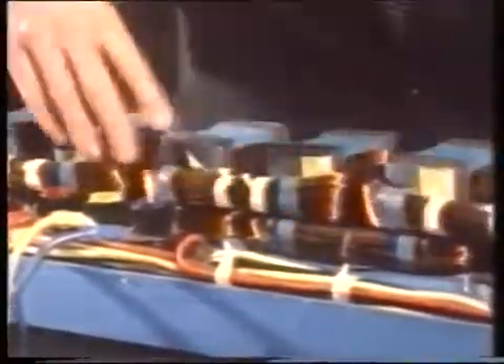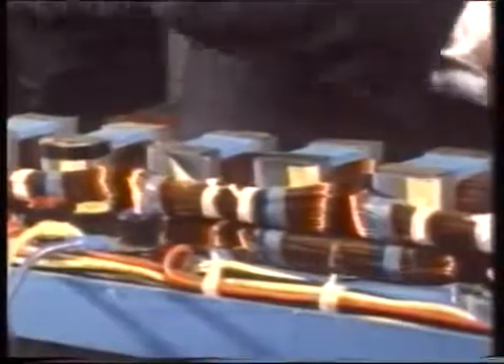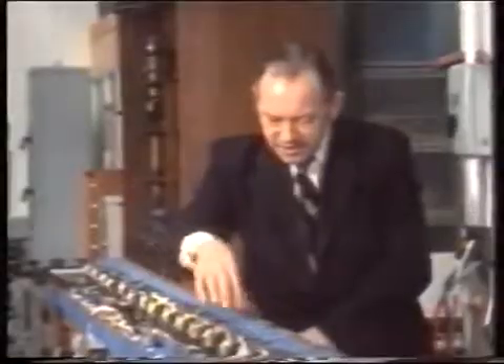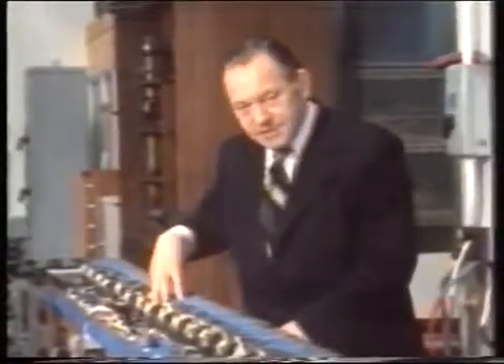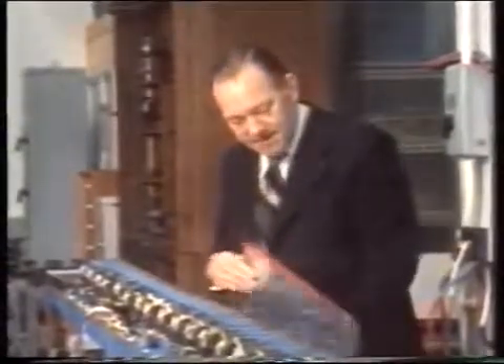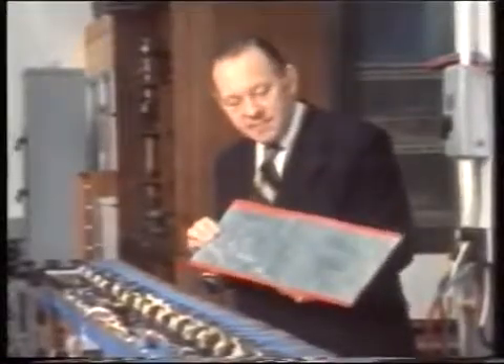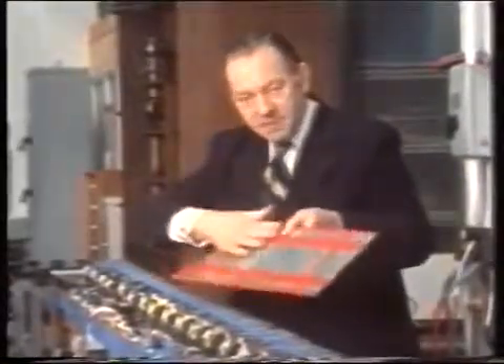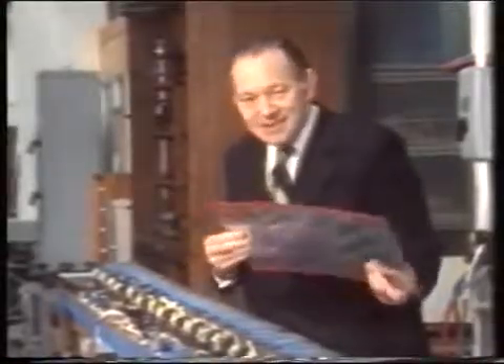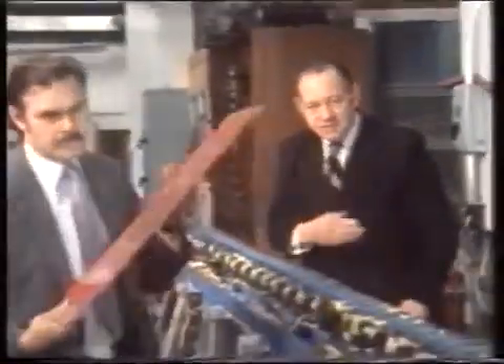Now here is one row of coils and the other one at the other side. But this time the coils have been divided up into groups so that we can produce a travelling field as well as give lift and guidance. The thing we're going to propel in the magnetic river is this sheet of aluminium — we've stuck some tape onto it so that you can see it more easily because it goes rather quickly. Put it on the end and switch on, and we'll have a demonstration.